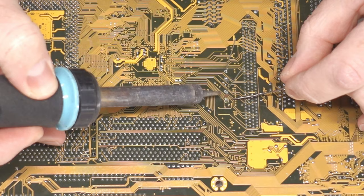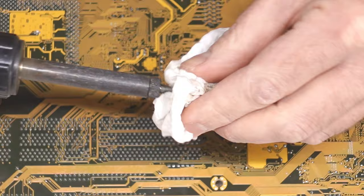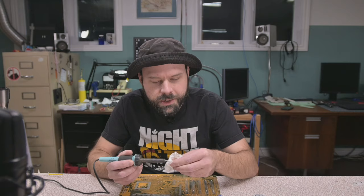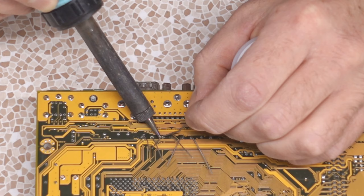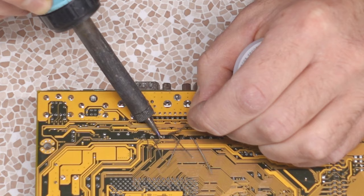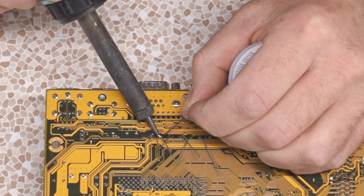The next part is the easy part — let's just solder these down without compromising traces. That's working real well — not. You gotta get soldered into that ferrule, it's not wicking down nice. Such tiny little holes, it's almost hard to get the solder into them. Sometimes instead of removing old capacitors it's better to just rip them off so that you have their leads still in the board and you don't have to mess with the little holes. I'm not liking the quality of solder joint I'm getting here. Let me trim those down and try to reflow it a bit better.